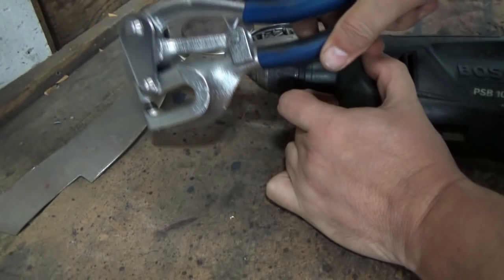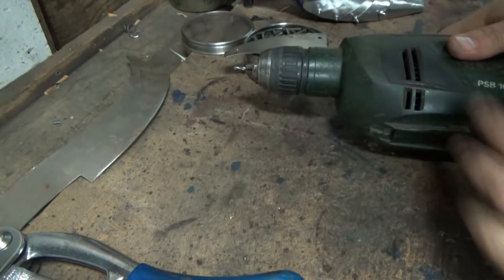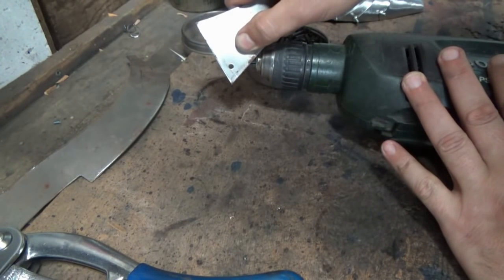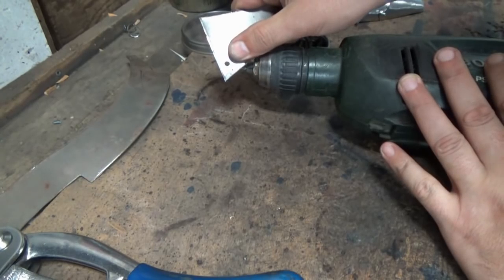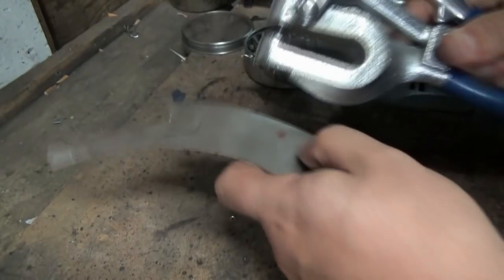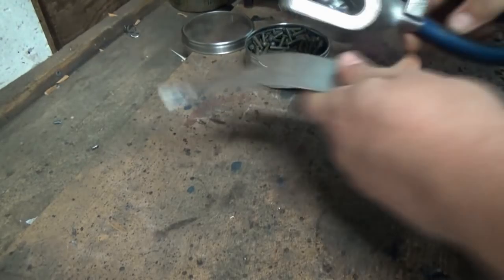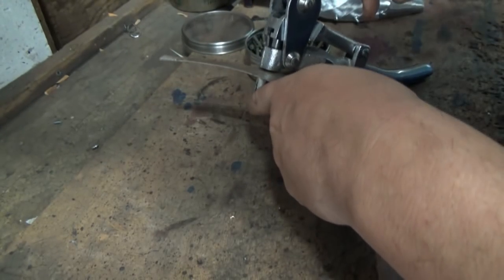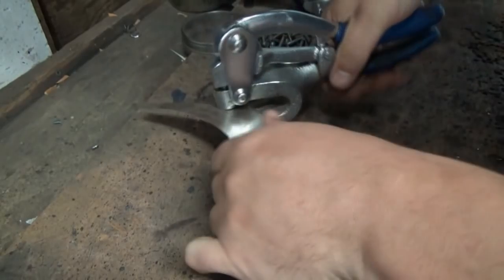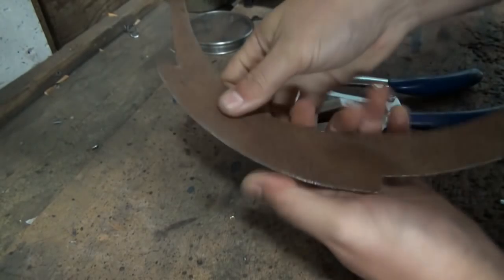Throughout most of this video I'm going to be using this tool, just using some mild steel. The first thing for riveting you've got to do is make the holes where you're going to stick the rivets through. I've started with one here — you can see just there, ready to go — a 5/32 hole, about 4mm. What we're going to do is put an associate hole in this piece. You mark the area you're going to use, put the tool on, give it a squeeze and you're done. A benefit of this tool over the drill is there's no burring — your hole's nice and smooth and you're ready to go.